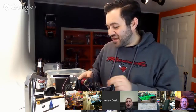But when we were running like XR10s, you know, or Bergs or whatever, those are 2-motor, 2 ESC setups, and we would run 400, 450 packs. Four of them? What's that? How many did you say? So we would run like a 400 to a 450 milliamp pack. Oh, it cut out, and I thought you said four of them. I gotcha. So I was like, well, why wouldn't you just use one slightly larger one? Weight distribution. Yeah. So we put one in every wheel, and it was great. Right. You could only go forward so long before you had to back up and unwind the wires.